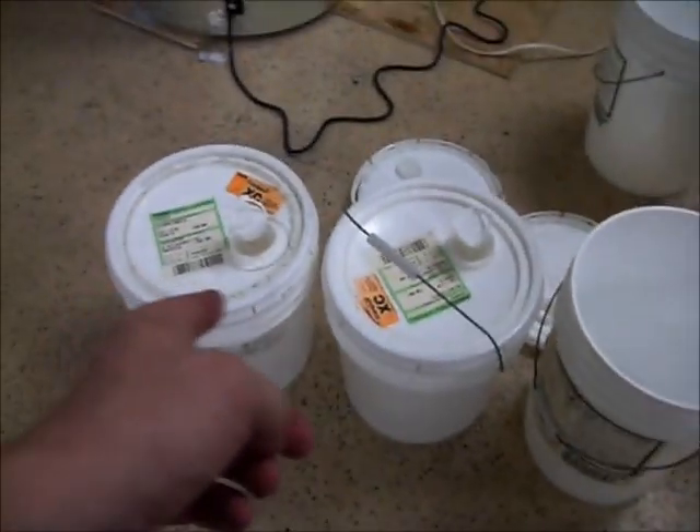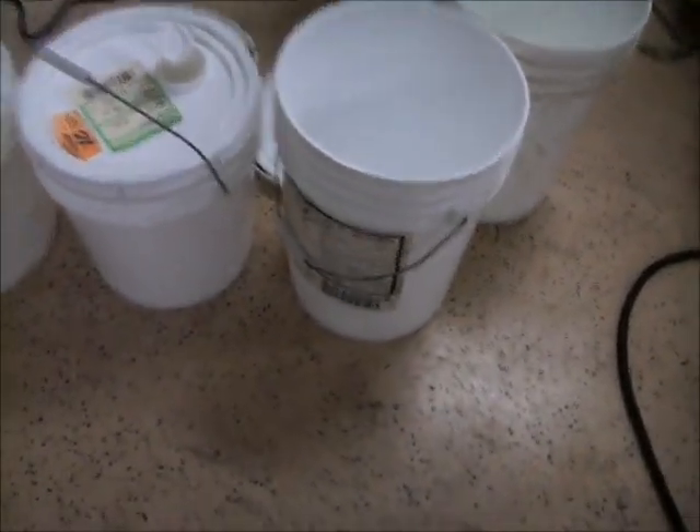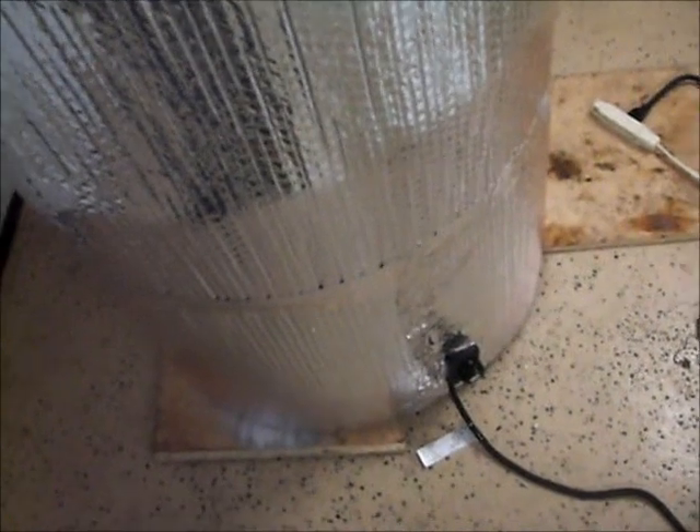Here's the start of my first batch — it's all virgin oil. We've got some grapeseed oil left over that we got back from a customer, some coconut oil, and palm kernel. The palm kernel and coconut are a little harder, that's what the bucket-shaped stuff is. I've got two buckets of grapeseed oil in there already. The drum heater is good to go once you've got liquid in there. Don't turn the drum heater on until you've got liquid in there, because it will get very hot and your insulation on the outside will start smoking.